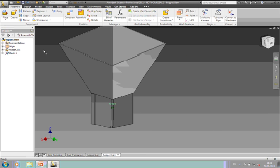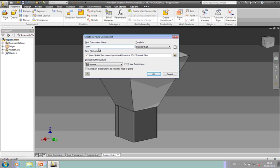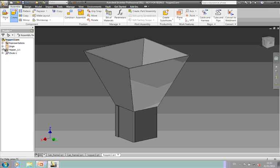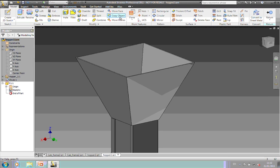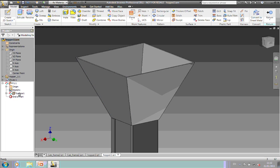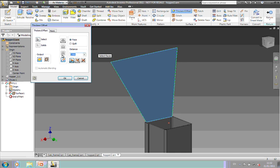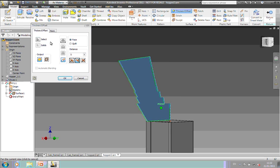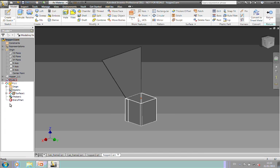Now the four panels on the hopper. I'm going to create a panel — I'll call this panel number one. I don't necessarily want to do a 2D sketch in this instance, so I'm just going to select the XY plane of the assembly and finish that sketch. Now I'm going to use a tool that is extremely useful in Inventor called Copy Object. I'm going to copy a single face from this hopper as a surface, turn off the visibility of the hopper, and now that I've got this surface I can thicken it by five millimeters in the correct direction.